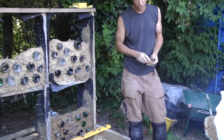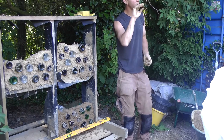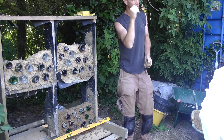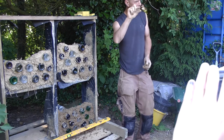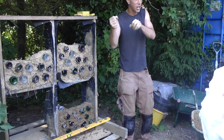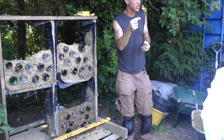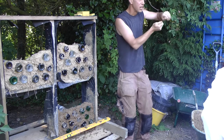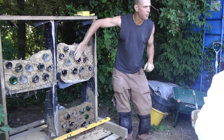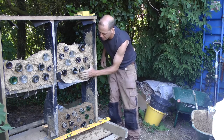Often people will advertise that they need a builder to come along and repoint the brickwork, where it's worn away from the weather and starting to fall out. There's a bit of a recess between the bricks. They still have mortar joining them, but it's falling out and you have some problems, maybe cracks. So a builder will come along and grind or chisel it all back about 10 to 15 millimeters from the front, and then trowel in a new mix so that all the mortar is flush with the brick face. It's just a reparation job that you can do to extend the life of your brick wall.